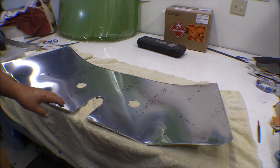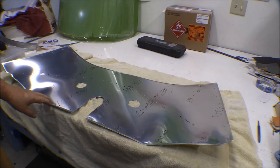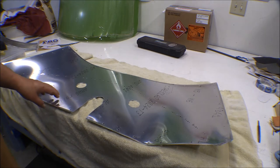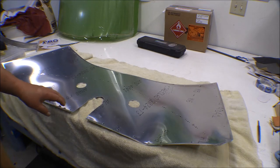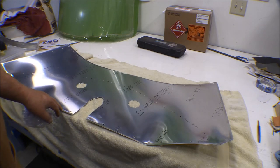Years ago, that's all I would have done. I would have washed everything with lacquer thinner, gone over it with a prep solvent rag before painting, and then painted it. But after I started powder coating, I found out that lacquer thinner is kind of dirty — it leaves a dirty residue behind. It never affected my paint jobs, but it does affect powder coat jobs, so it may have had a slight effect on paint jobs too that I just didn't attribute to it. So once I get it cleaned up with lacquer thinner, I'll probably wash it with acetone.